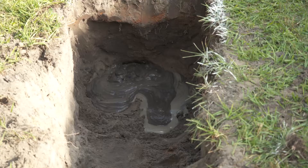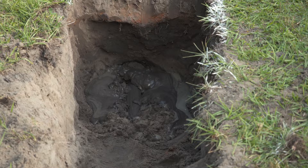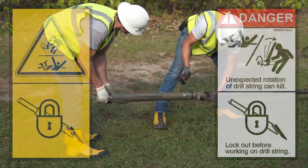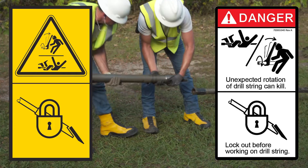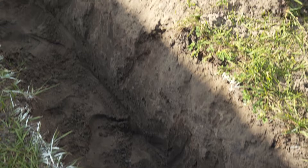When the pilot bore is complete, there are some essential safety precautions to follow when changing tooling and pulling in product. Rotating drill rod can kill — unexpected startup is possible. Always lock out the machine before working on or near exposed drill rod. It is essential the machine is locked out before approaching the drill head for: changing tools, adding a product, applying a wrench or other tool to the drill string, adding or removing drill stem, doing any other work on the drill stem or tools at the exit end of the pilot bore, or entering an exit pit.